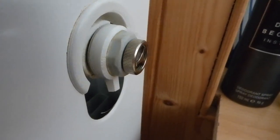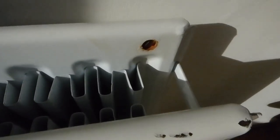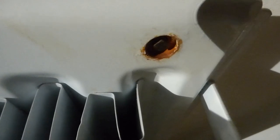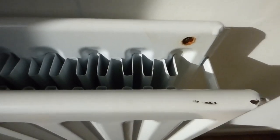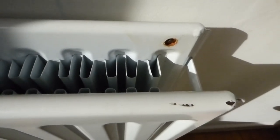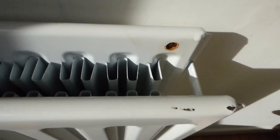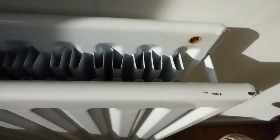But what do we do if we haven't got one of those and all our radiators have got these instead? Here are some radiators that are fitted a lot - what have you got? You've got a bleed valve at each end, but there is no way of getting any inhibitor into these type of rads. A lot of other rads do have just the end stop as shown in the video just now, but it's sealed in, it doesn't unscrew - it's just a bleed valve and you can't get any inhibitor into the system.